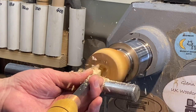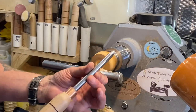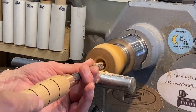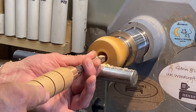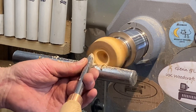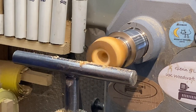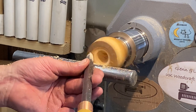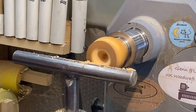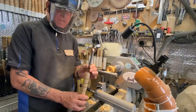And I say this is the box hollower on the square bar, exactly the same with the round bar here. Works exactly the same. But the round bar's nice sometimes when you want to take these sort of cuts. It's nice because it's on a round bar, so you can just roll it. You can do the same with the square, it don't matter, you can still come in and do it like that. Okay, but it's just nice on the round. Now, I do this square, the R2 and that on a round, on a spindle one.